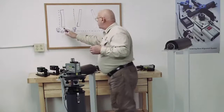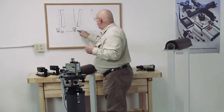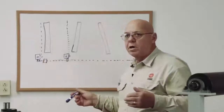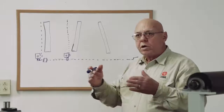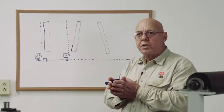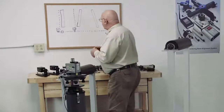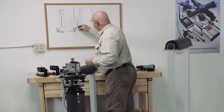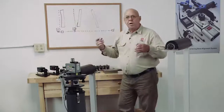So we can pick the laser and the floor stand up and move it down to another section. We're going to adjust this laser plane to be bucked into these two reference targets. The numbers don't have to be zero — we're going to adjust it until both targets read the same number, same sign. It just creates an offset center line. Because the squareness is built into the laser, when we buck into these targets, we create a plane here that's parallel to what it was at the beginning.